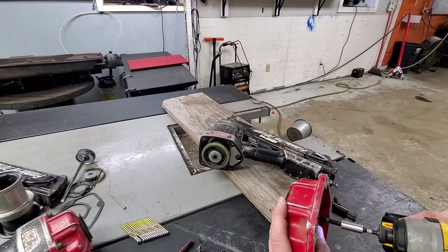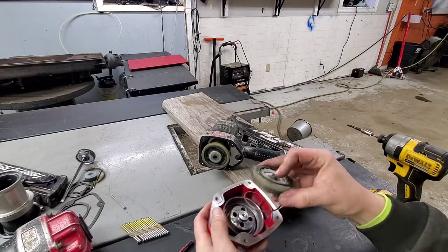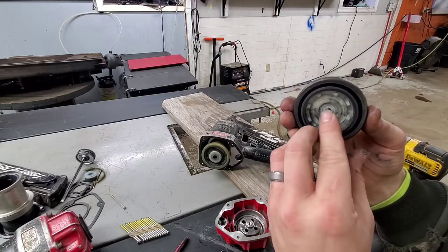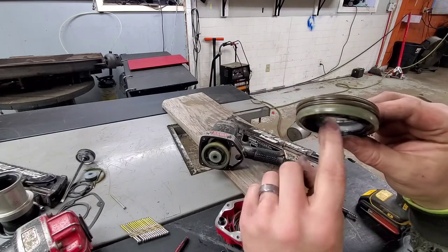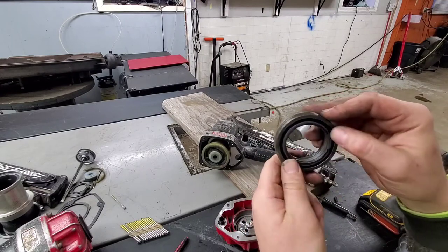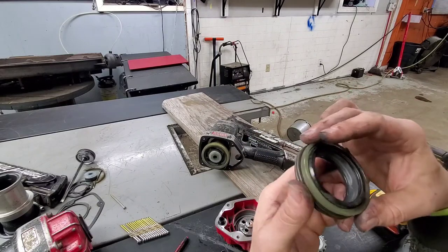So there's no leaking coming from it. If there was leaking coming from the back or anything like that, I would tell you it could possibly be. There's supposed to be a notch out of the side here on this, so don't worry about that. But the plastic piece here, a lot of times around the inside, will get a crack in it, or around here somewhere. It'll just have a small hairline crack, and that'll cause it to skip, but you won't notice any leaking also. So you want to pay real close attention to that.